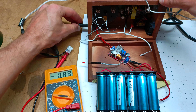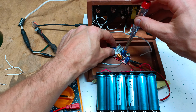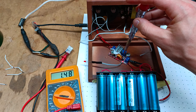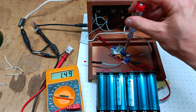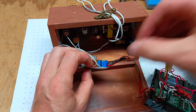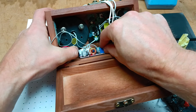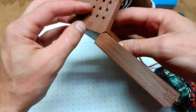As you can see, after connecting the power supply to the power box the red LED lights up, indicating that current is flowing to the cells, which means the charging process is underway. I set the charging current to 1.5A — I could set this value to around 3A, but slower charging of the cells will result in a longer lifespan. Then I install the step-down converter in the power box housing and start making the last connections in the power bank's power circuit.